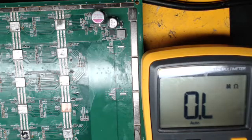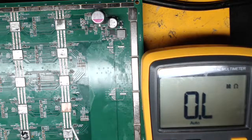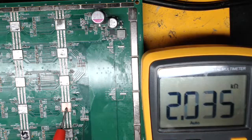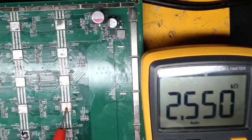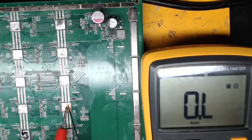Let's get started. I'll have to take this back out and test it later after we work it, but I want to show you how to test the resistance — usually you couldn't quite see where I was poking. Generally it's safe to test the resistance right after you do the chip, even when it's hot. I put my positive probe on the chip and sometimes you have to dig it in. There are five test ports — the middle test port is the one I always test first. It should be around 2.5 kilohms, like that. Before on this chip I was getting about five, but now I'm reading 2.549, 2.520, 2.549.